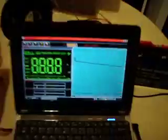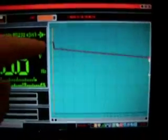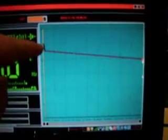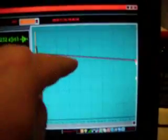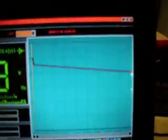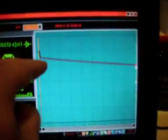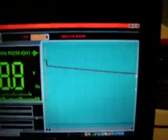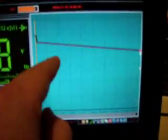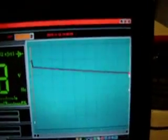Okay, just wanted to show you guys the graph that actually came out. So there we've got 13 volts that we started on. As soon as we turned it on, it dropped down, but then it's steadily lost its charge. And we got below 12 volts there. So we got 13 and 12 volts there. It's very steady. Over the 2 hours that we were draining this battery, around 1.2 amps, it was very steady. No huge jumps or anything like that. The battery seems to discharge quite well.